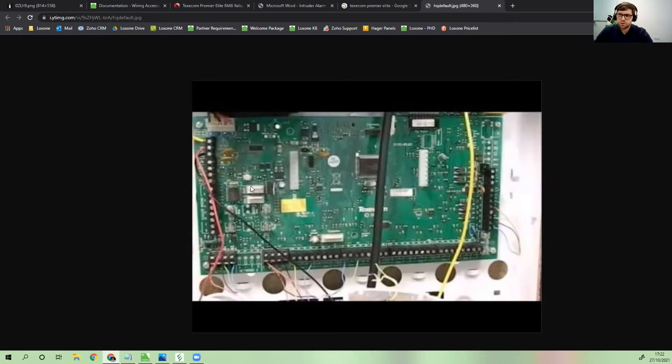For this integration you need the RS-232 extension from Loxone, plus the Texacom PC com lead — the bit that plugs onto the com port on the Texacom panel, with a DB9 nine-pin RS-232 connector on the other end. It's quite an expensive cable at around £25-30, so don't damage it. The most important thing people do wrong is chopping off the DB9 end. You cannot do that — the com port side is TTL, and the cable itself is a TTL-to-RS-232 converter. If you chop it off, it will not work.